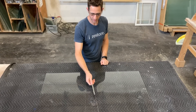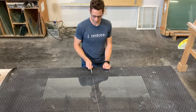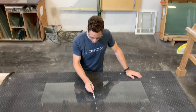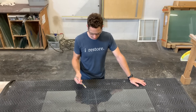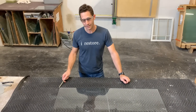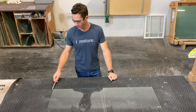I'm going to tap the line and see what happens. You can see how much it scored — a decent amount — but it didn't break. I guess that's because I didn't get through the compression layer. I can hear it still doing little cracks, but I'm guessing it didn't get through the compression side. The other thing is that tempered glass is really fragile on the edges, so we're going to try tapping the edge and see what happens.